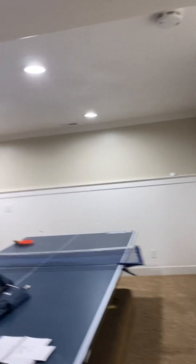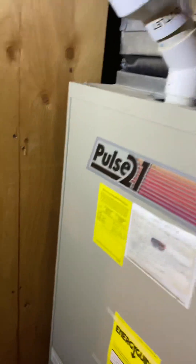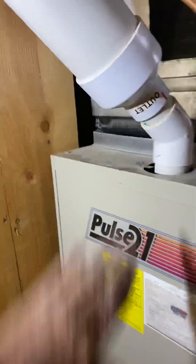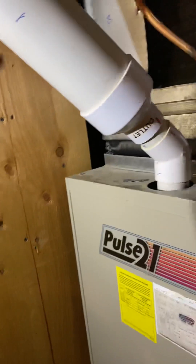Your cut line would just have to be where you need it. Combustion air is okay right there. On the scope, Dwight has a 110,000 BTU furnace — this is a pulse with 2-inch flues. I talked to Dwight and he's going to order a 90,000 BTU furnace. We're downsizing so we can use these flues. Make sure you have the 90,000 BTU furnace because we can't run 2-inch flues on a 110. We're going to reuse these flues and get rid of the mufflers.